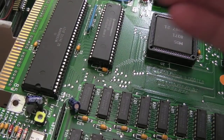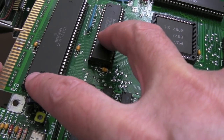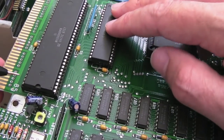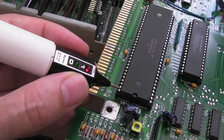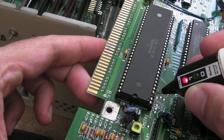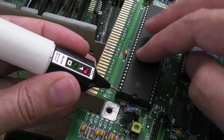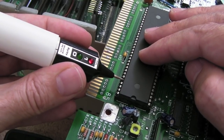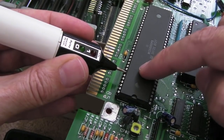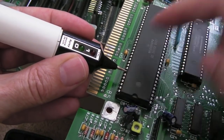I should have slowed down a bit instead of focusing on the data path stuff. I'm going to have a look at the ROM pin out and work out where D11 — the 11th bit pin — goes, and double check that it's supposed to be connected. I'm testing connectivity; we found one data bit that was not connected. I then went to the address bus — because it still wasn't working — and found an address bus bit, I think it was A7 or A8, wasn't connected either. So I've connected that. These are data pins — let me show you. D0, D1, D2, D3, D4 — you can see some highs, lows, pulsing. Then on this side: D5, D6, D7, D8, D9, D10, D11 — why is D11 floating? It's trying to read from the ROM and we've got a floating pin. The 7th one up here needs to connect to the relevant place on the ROM.